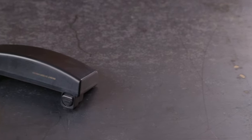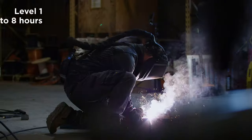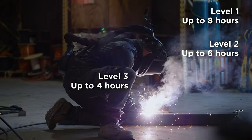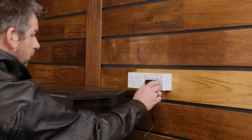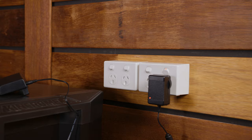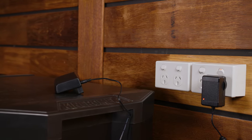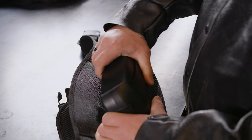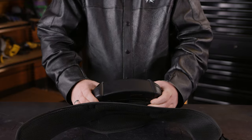The lithium-ion battery is 4,400 milliamp hours and can give you up to eight hours of use on level one, six hours on level two, and four hours on level three. The battery can be charged in the unit or separately. Unimig sells additional batteries so you can always have one charged as needed. It is recommended to charge the battery if it hasn't been used for a few weeks, as lithium batteries slowly lose their charge over time or through very cold temperatures. It will take between three to four hours to fully charge, and the battery will give you an audible chime when inserted correctly.